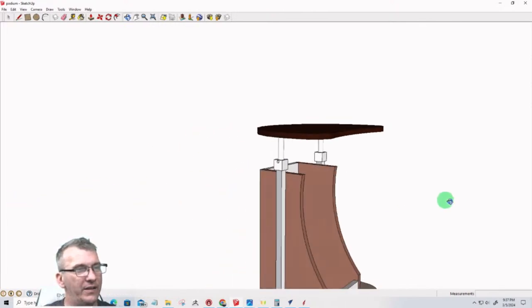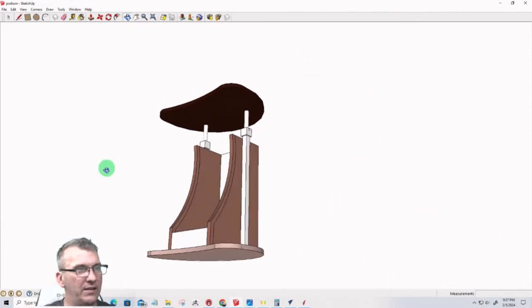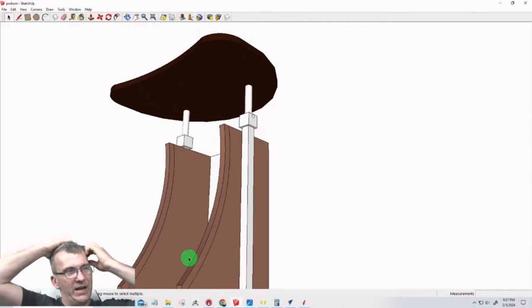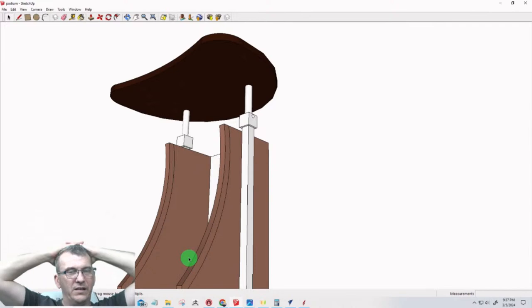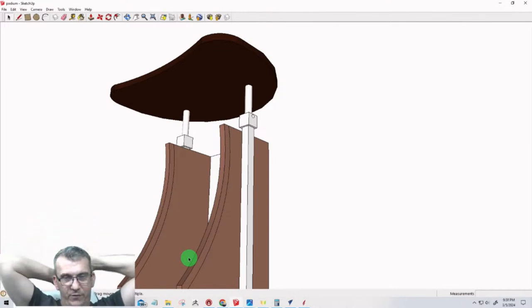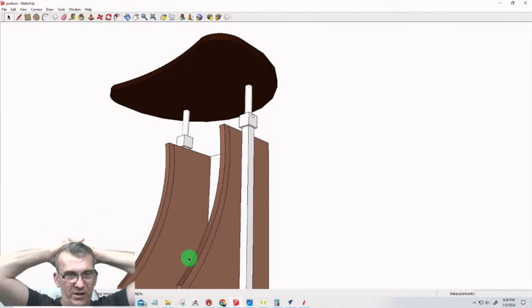I will have everything ready for tool pathing. I've just got to go through and make the spacing, that 16th of an inch spacing. And that's going to give me the curve for the molding toolpath or the 3D modeling two rail sweep. And that's an easy cut. Those won't take very long to cut that front.